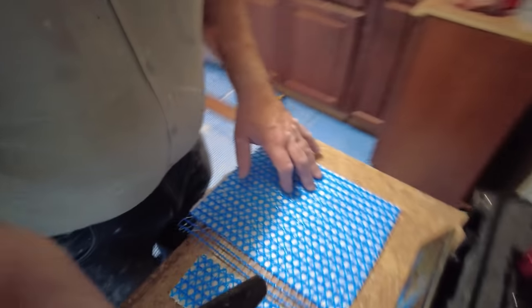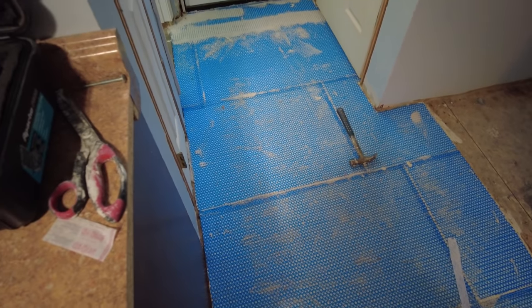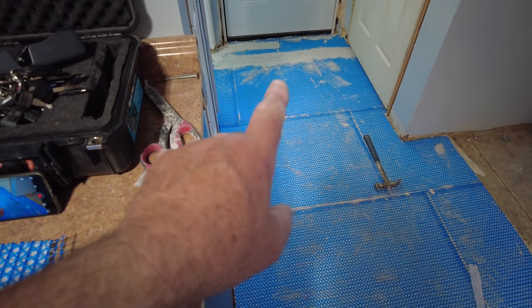I had several places where I did that — I had some scrap pieces I didn't want to throw away. This is great stuff when you have a problem floor, or you've got marble or natural stone tile that you want to install without installing a second layer of plywood. In this case we have a tile floor that's borderline, and a subfloor that just barely reaches L over 360, so we added Permat to stiffen the floor and give us a little stronger floor when we're done.